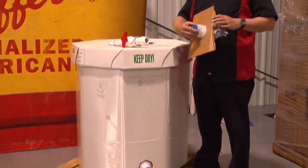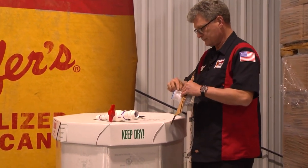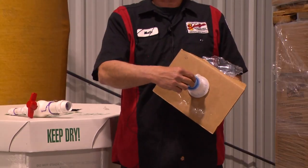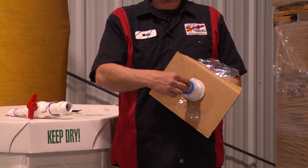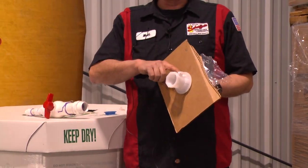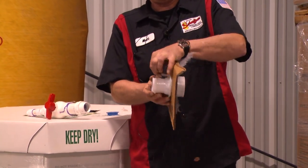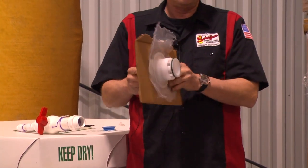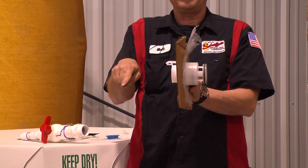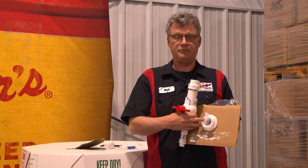All the valves come with a tie strap around this to prevent accidental actuation, and they work very, very simply. You take the cover off to prevent accidental spillage — it's just there to protect during shipping. You remove the tie strap. Then you lift up on this and you push in, and the oil flows through here and out there. This thread form here is a one-and-a-half-inch NPT.